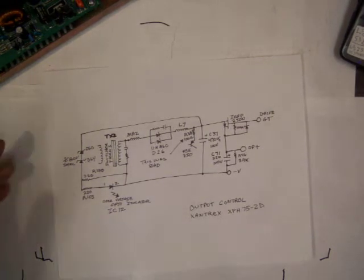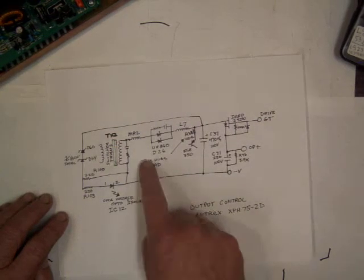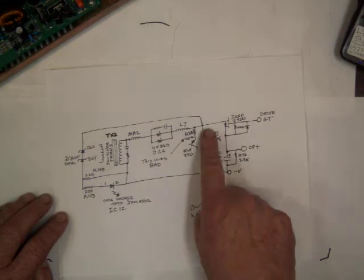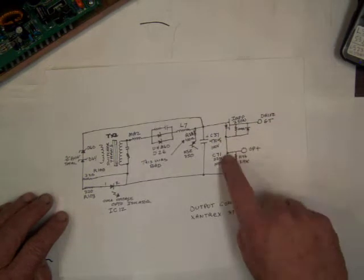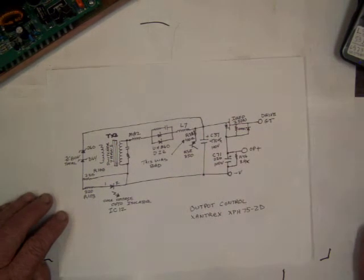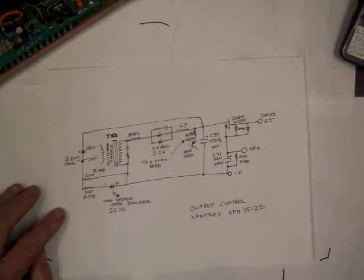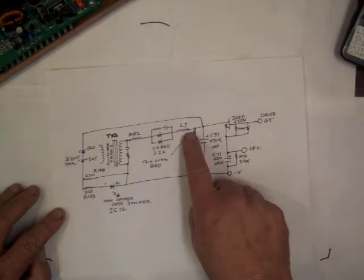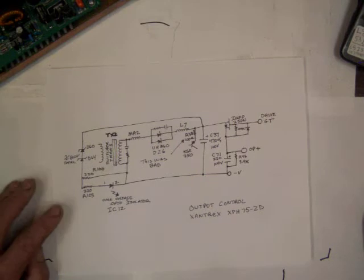But anyway, I still tried forcing this thing, and this supply just always wanted to go high. And this is crazy because you've got two inductors, a diode, a capacitor, and the IRF250. So there's a capacitor on each side of this. You might be able to switch this a little bit, but basically they were running this in the linear region. And this actually happened to be like it ran from magnetic core saturation. So the inductor is basically a high impedance source, and as you start drawing current through it, it puts it into a nonlinear region. I don't know, never seen one before.